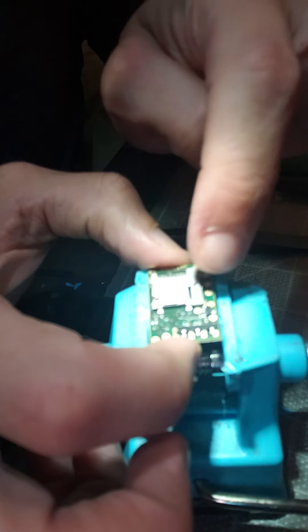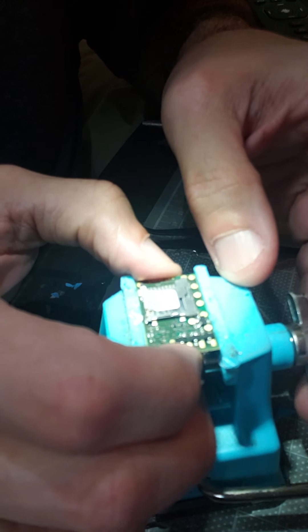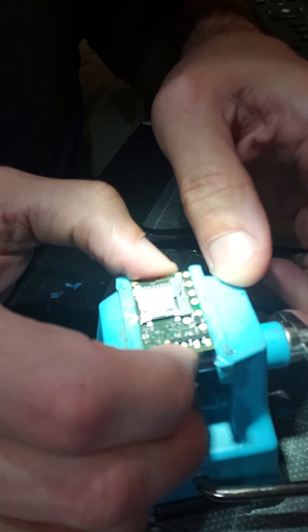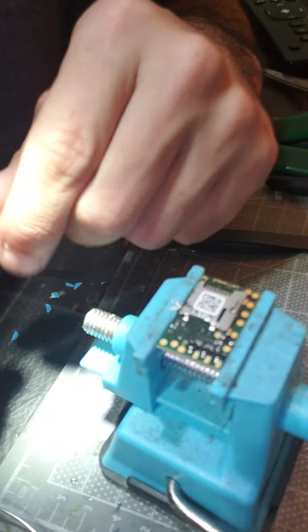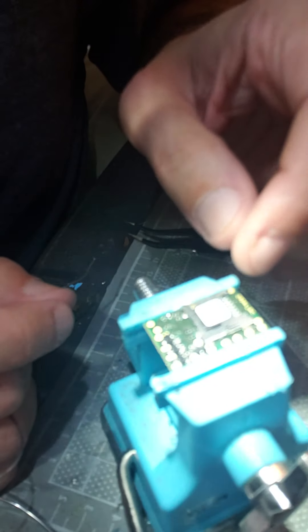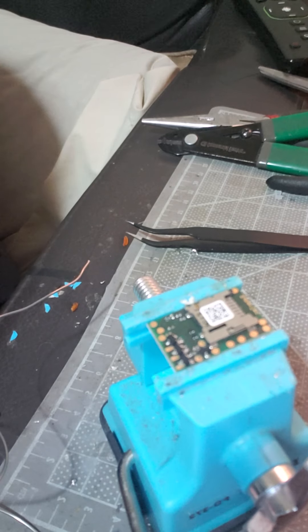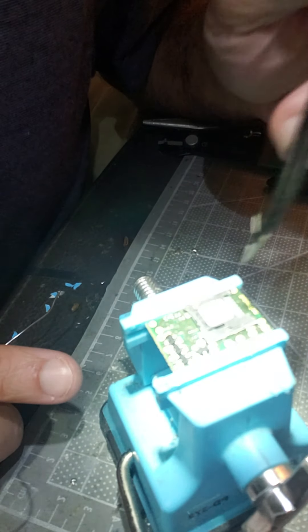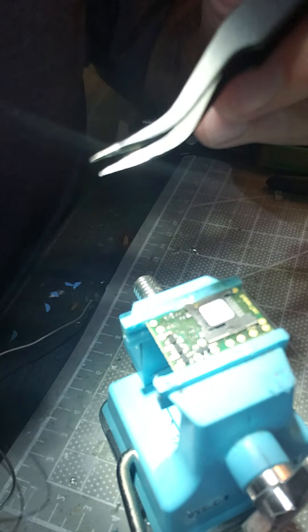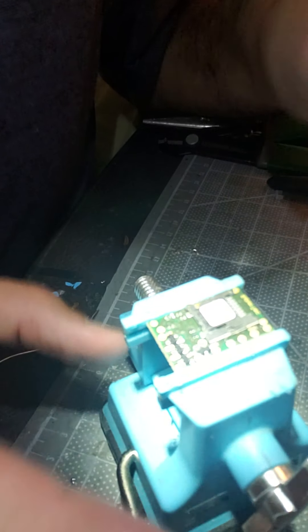Back here you can actually do different tabs if you're going to do some power switches over the top for those Obi-Wan ones. I did a little something different on my Obi-Wan. In this case I need — let me look at my wiring — one, two, three from the top. The third one from the top: my ground on this board. It's not going to be the same for the production boards, this is beta, but my ground is going to be this one, so I need to solder on that one there.